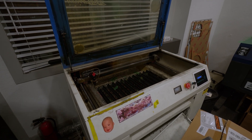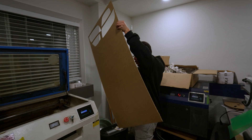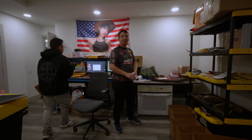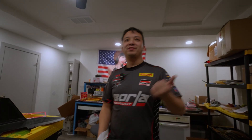We're going to load eighth inch acrylic. Carl, our technician here, can you please load in acrylic and show them how to do it? And while he's doing that, I'm preheating our oven to 280 degrees Fahrenheit. How do we bend these panels to match the curve, you might ask? With an oven.